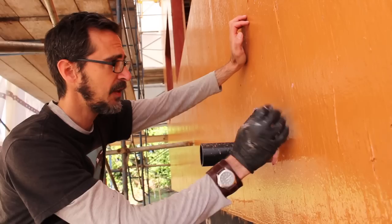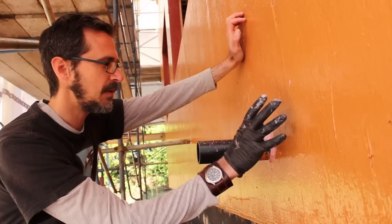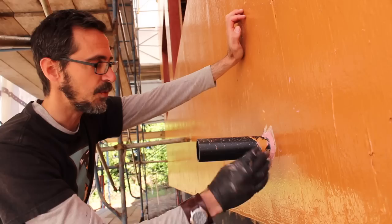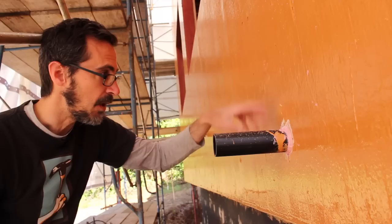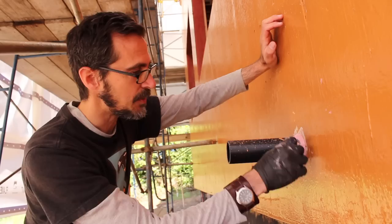It can become a little messy if you really start tooling it a lot, so try to get it on there fairly well right from the beginning. Once you've applied your joint and seam filler, we come back with Cat5, fill in any spaces that were missed, and roll it right out onto the pipe — maybe an inch and a half to two inches out. The beauty of these products is you could also use the Fast Flash — the same product used in window openings — which tools really well. The Fast Flash you can do with a Bondo scraper, troweling it all the way around the opening and painting it right onto the pipe penetration.